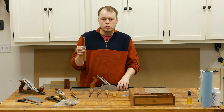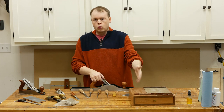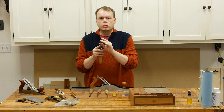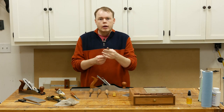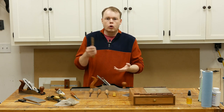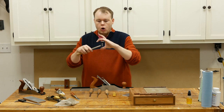As you can see, my process for sharpening chisels and plane irons is really straightforward and pretty simple. Setting up new chisels takes the longest because you've got to flatten the first three quarters of an inch of the back, but this process makes that relatively simple. With a coarse stone, 1000 grit, and 8000 grit, you can have the same results. One thing to keep in mind: sooner or later that primary bevel is going to get consumed by the micro bevel — the micro bevel gets taller and taller. You'll need to take it back down to the 25 degree primary bevel using coarse materials: an extra-coarse diamond plate, 60 or 80 grit sandpaper, or a 120 grit water stone from Shapton.